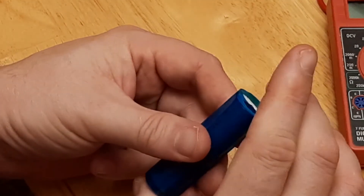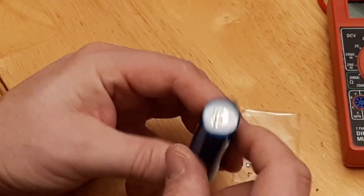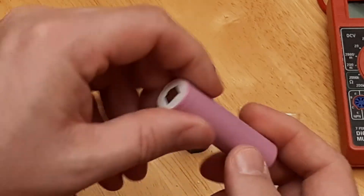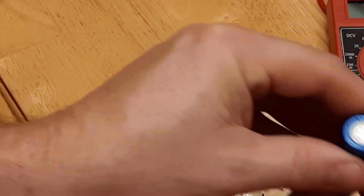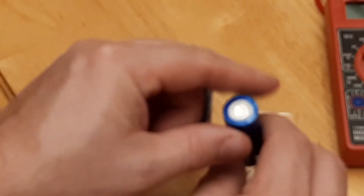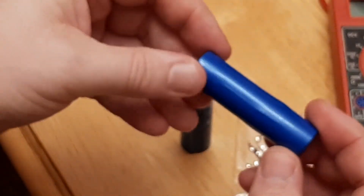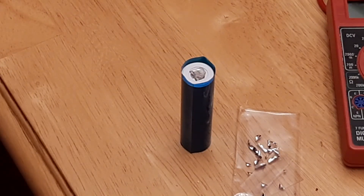With the extra ring on, I get the battery down in the sleeve, make sure I have no debris in my sleeve, then heat-shrink it down with a heat gun. My end result instead of just having the raw harvested cell is a much more wrapped, much cleaner battery. I feel much more confident in the serviceability of this battery since care has been taken after harvest.